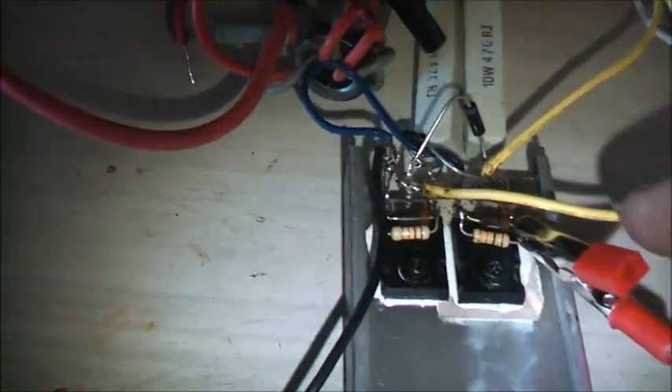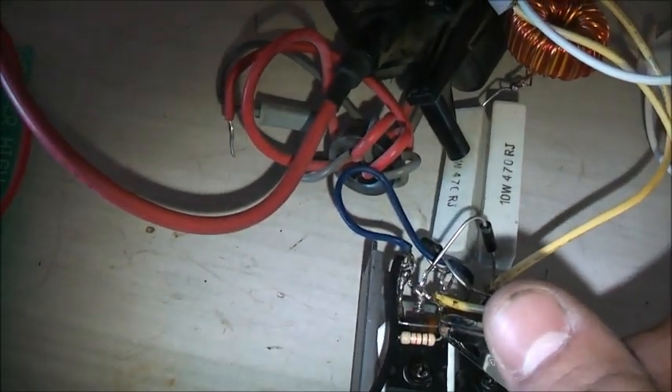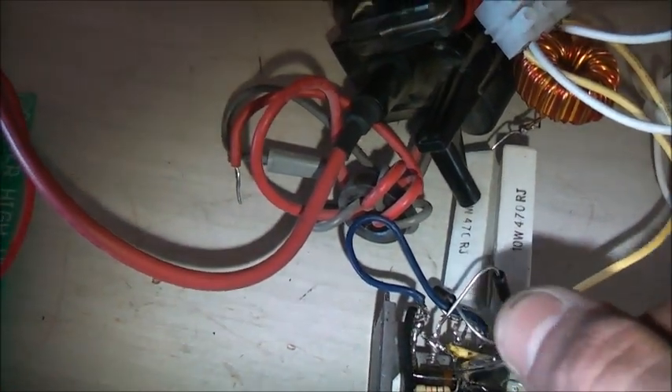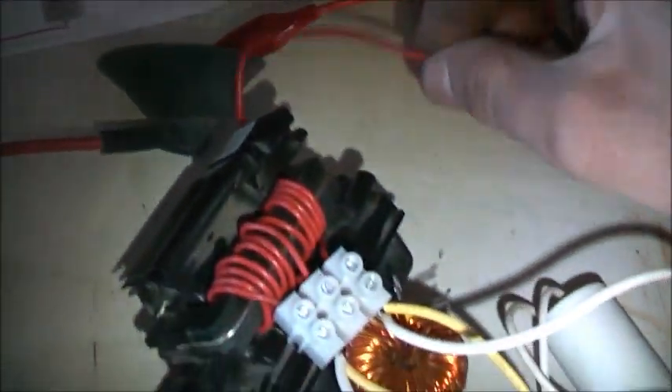Basically how I've got this hooked up — I put power in, so I've got the first leg there, putting power here. So I'm bypassing the resistors and it's working. Power off, let it discharge that capacitor. Now it bypasses the resistors and it works.